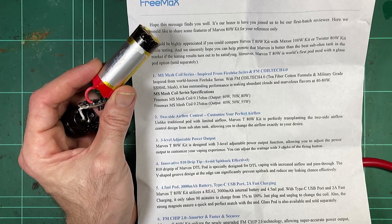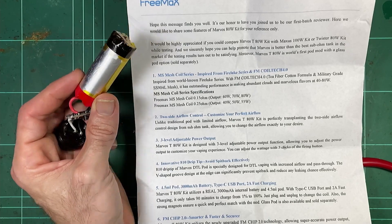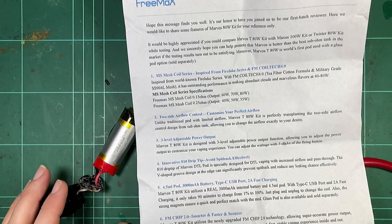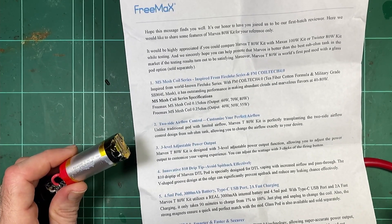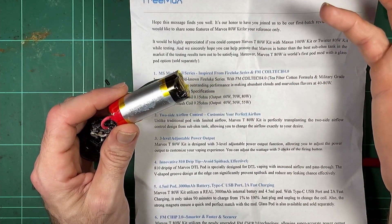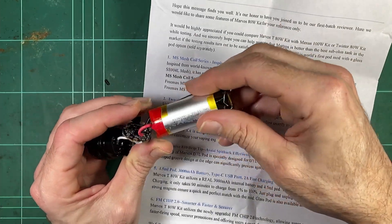Well over 20 amps — think about this: at say three volts it's going to be 80 divided by three, about 30 amps, at its highest when the cell's almost dead. That's a fair bit of current — a lot of current for a little cell. So we'll do a high current discharge on it and check the capacity.